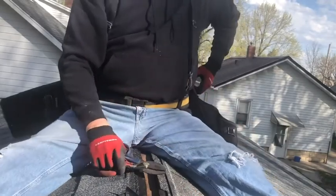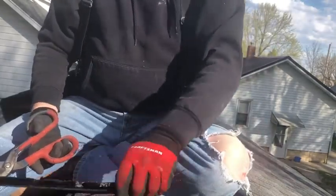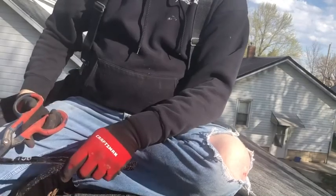You could try to cut this with a utility knife but I'm telling you right now it ain't gonna happen — you'll have no blade left by the time you get halfway down five feet, because you cut through the stone. That's why you always cut on the backside of a shingle when you cut it for length: score it and then just snap it. The warmer it is, the better it works. You guys have an idea what I'm doing here — I'll bring you back when I've got that all done.